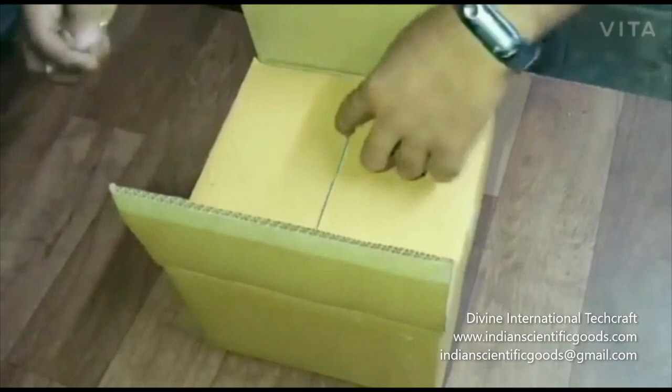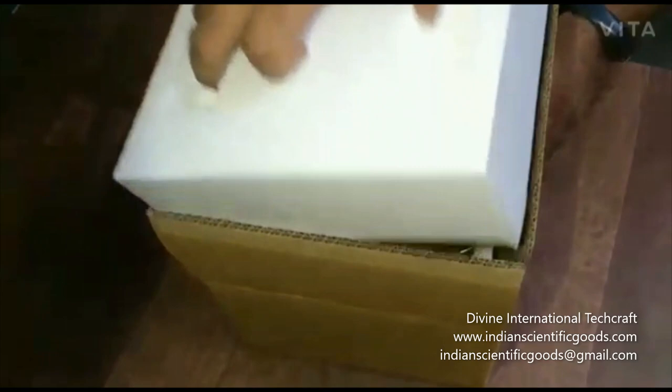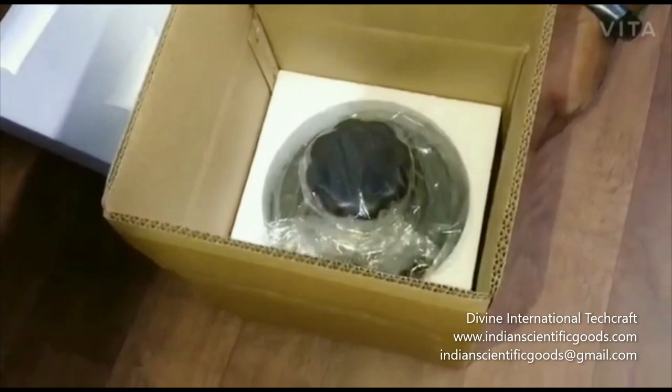The cutter has been specially designed to make it portable and lightweight. Only the fabric is to be gripped between cutter base and rubber pad. Cutter top is to be rotated gently in clockwise direction for accurate cutting of fabric. The cut fabric can be weighed and multiplied by 100 to get GSM.